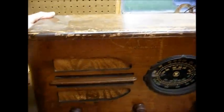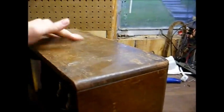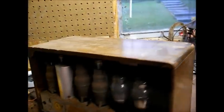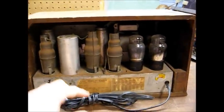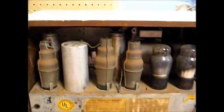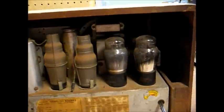This is in a wooden cabinet — the finish is a little worn on top, but that's not my concern right now. Getting it operational is my concern. This is a five-tube set that uses a power transformer and looks like a decent-sized speaker up in there. And there's the model label tag with the tube chart on it.